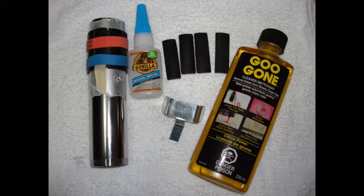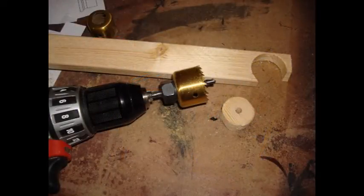For gluing up the black big square, put wax paper over the chrome pipe, then put the black big square on and used Gorilla Super Glue to glue it together. Used elastics to keep it in place as it dries. Use a scrap piece of one-by-two, which is inch-and-a-half width and thickness is about five-eighths.